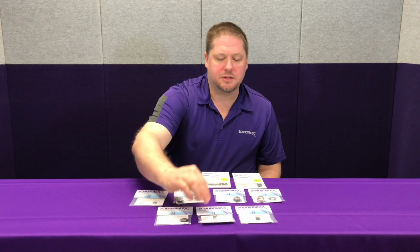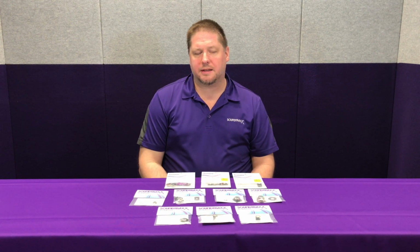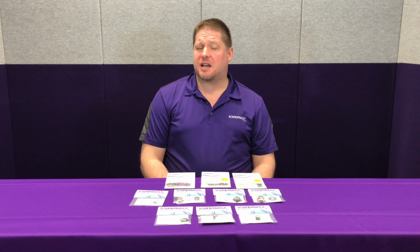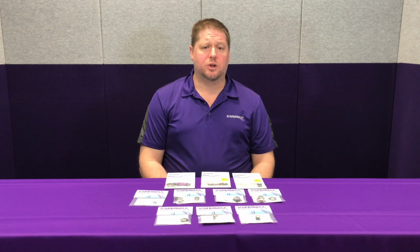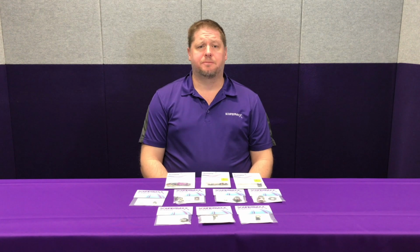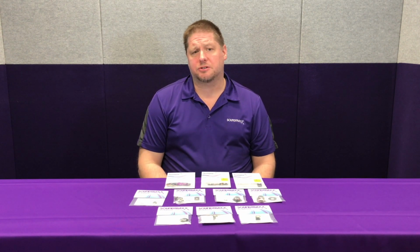Now, another way to help fight the power rating is to lower your volume. So if you have to use a 1-watt speaker with a 2-watt amplifier, you can cut your volume to about 1/2, and therefore you're not overdriving the speaker. But keep in mind, anytime you reset that decoder, it's going to go back to a master volume of 3/4, which will then potentially overdrive the speaker. So this is one of the biggest things that you want to pay attention to when you're installing your speaker. So now let's take a look at some wiring techniques and how to do your speakers.